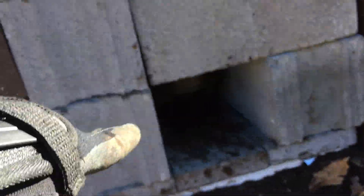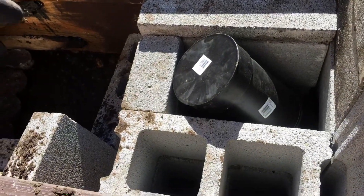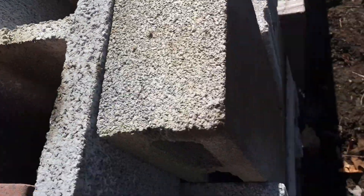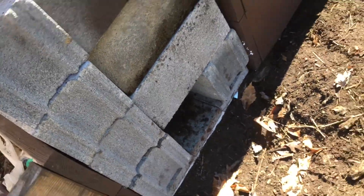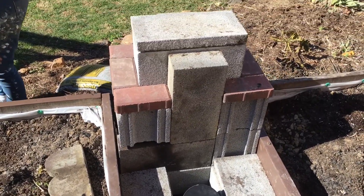We'll build our mass coming off of this — our thermal mass — but additional thermal mass will be coming off of that as well. So the air in theory gets sucked down that pipe once you start a fire on the very bottom, comes up through the chimney, you get it going here, you get a good pull on it, then you put this lid on — that pull will continue, and then the excess after it gets burnt up will exit this hole, heating the additional thermal mass.